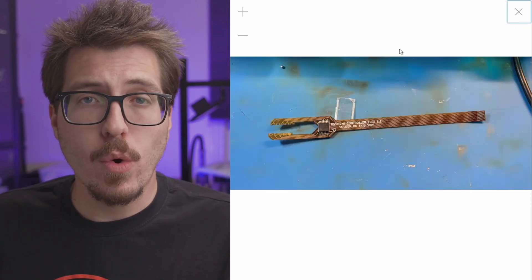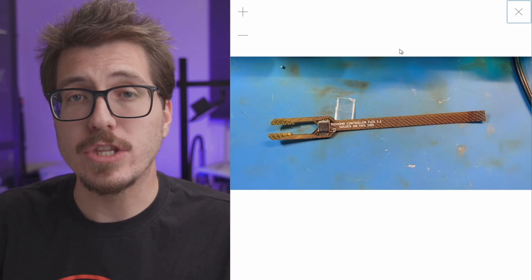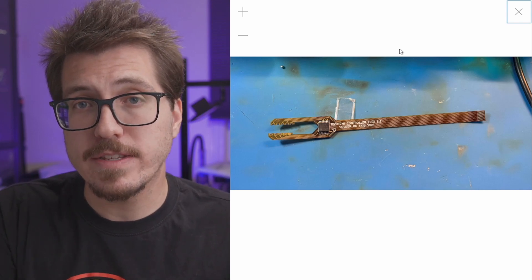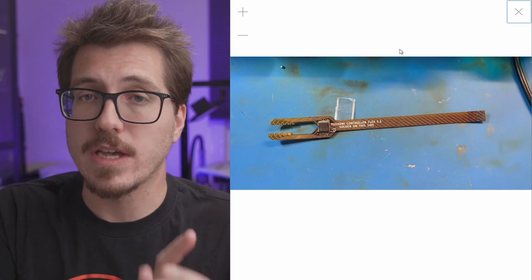The good news is there are fixes for both the N64 Digital and the PS1 Digital. I'll leave a link in the description where Darth Cloud, the creator of Blue Retro, goes into the exact issue. The fix that Dan has come up with is a new mini flex that goes onto the flex cables for both the N64 Digital and PS1 Digital, with some kind of buffer on the controller lines. Note that these adapters don't come assembled — Dan will provide a flex cable and a short bill of materials, so you'll need to order a couple of parts and solder them on yourself.